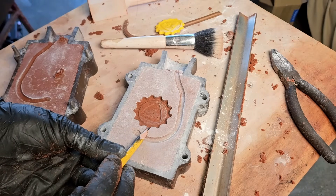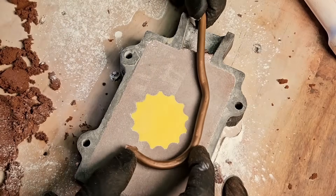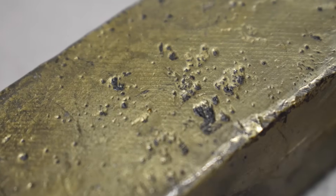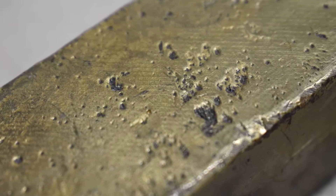A flask this small kind of limits how crazy you can get with gating, but I tend to like forming the gates with something like this piece of copper pipe that I've bent, or printed patterns that can form the gating. Some people cut the passageways with a spoon. The real test is how good the part looks at the end. If it's full of holes or looks like sand and metal soup, you probably screwed up the gating somehow.